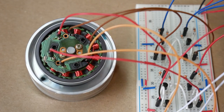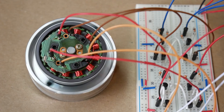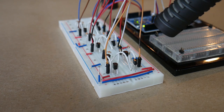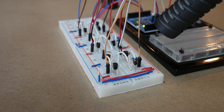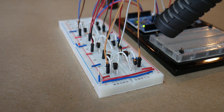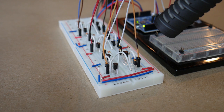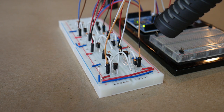I thought it was interesting that you could hear the motor running. Since it doesn't have brushes, it's basically a brushless motor. I don't know if this falls under the magnetostriction that Ben Krasnow in Applied Science was talking about recently. But more interesting than that — if you lift the motor up and damp it with a glove or your hand, and put the mic right down near the circuit board, you can actually hear what I assume must be the transistors clicking on and off. I checked the frequency from the mic, the little spikes on it, and it lines up pretty well with on-off clicks for each one.